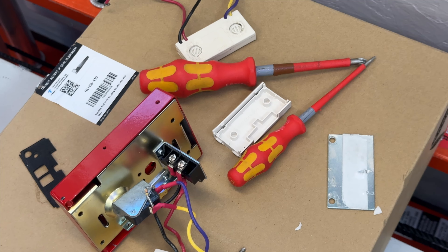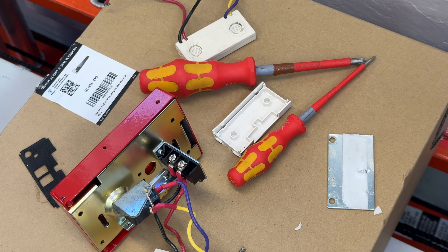This is not at all to say you couldn't fix this and make it addressable — you absolutely could, you could re-solder on that module. Again, totally not legal for a real building. Do not do that because at this point this has no CSA listing. You cannot install any electrical device in this country without a CSA listing, and for the US there's UL — and we have ULC, the Canadian ULC listing. It needs to be CSA.